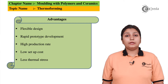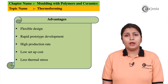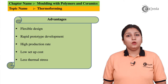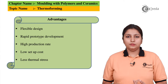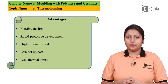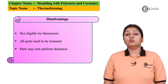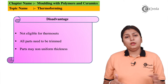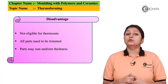There are many advantages and disadvantages to thermoforming. The advantages include that less stress is required and the object forms in the well-shaped final pattern. The major disadvantage is that you cannot make thermosetting plastic through this process. Also, exact trimming is required for the final product, otherwise the product is not made properly.